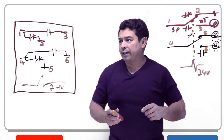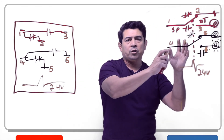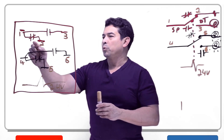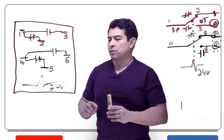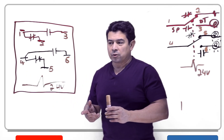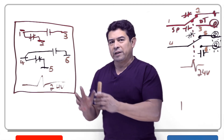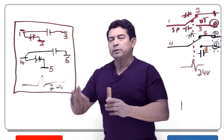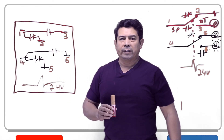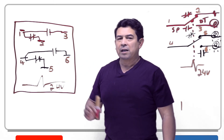So just like on this relay example, you put power to this and all of these switch positions. You put power to this: this one will open, that will close; this will open, this will close. In this example the coil is 24 volts, but they can be 110 volts — it just depends, you have to check that. And we'll talk about all of that in a different video. But this is what they call a general purpose relay. This is the basic operation of it — this is how it works.